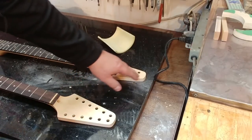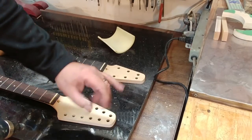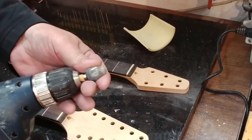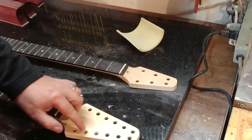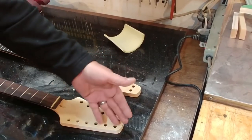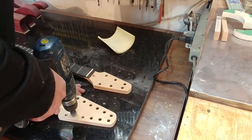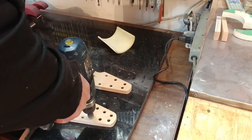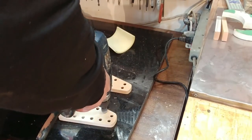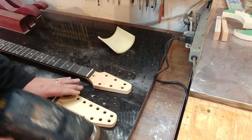Here's a little tip: when working with maple especially, it chips really easily, so you don't want sharp edges around your drilled holes because that's where chips start. I use a beveling stone — the kind for grinding valves, available in kits — that fits in a drill. I just run it lightly through each hole to chamfer the inside, giving you a smooth rounded edge leading into and out of each hole, making it much less prone to chipping.